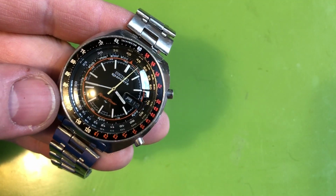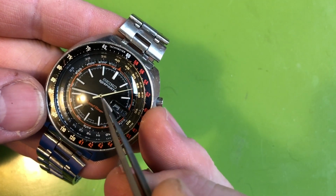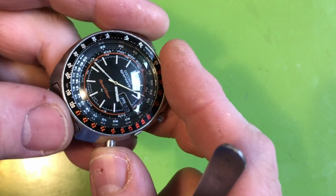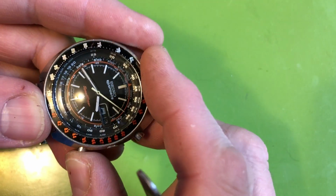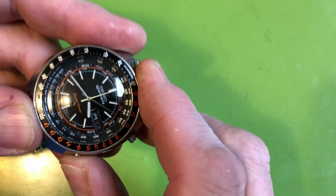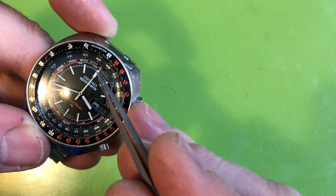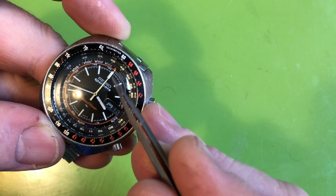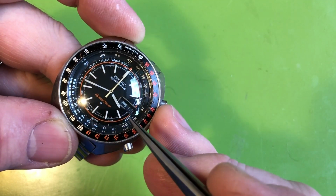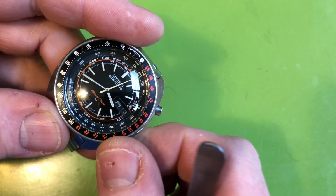The only thing you're going to see, these sweep hands are pre-keyed to the chronograph wheel. So what that means is that they're set how they're set. Sometimes things bend a little bit over the years, and this one certainly did. It resets ever so slightly to that side. There's no way that I'm aware of to change that without causing any real damage. So hopefully that is okay.